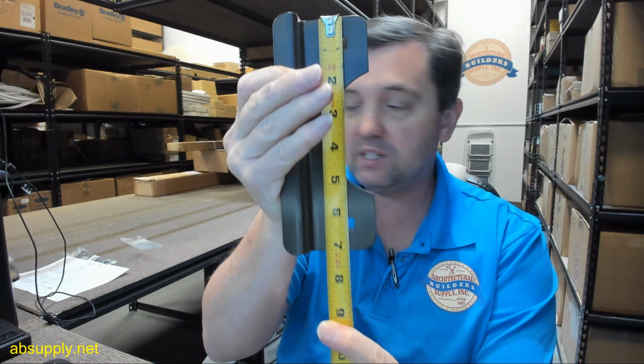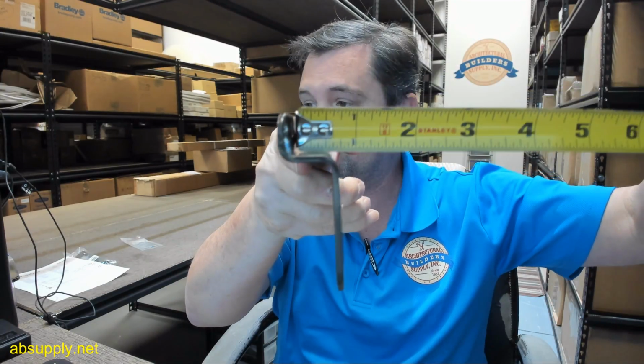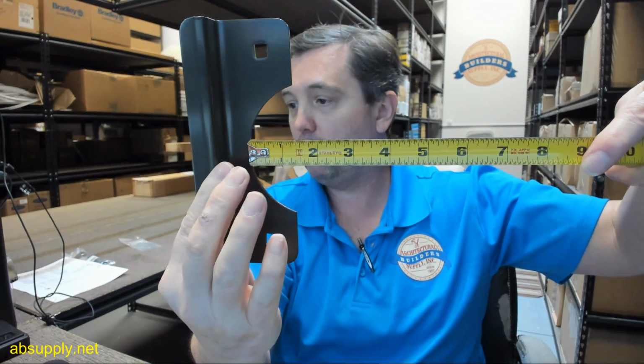7-inch tall, that's indeed correct. They have an overall of 2 5/8, and I'd say that would be correct as well. The next important thing is that offset, and that's 3/4 inch according to the drawing. I'd say that would be spot on. They've got a radius of that cut at 1 5/16. That appears to be correct. So if your lock is going to be 2 5/8, 2 9/16 diameter, it will certainly work with this very well.